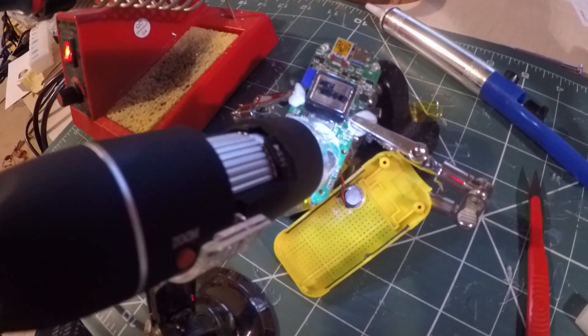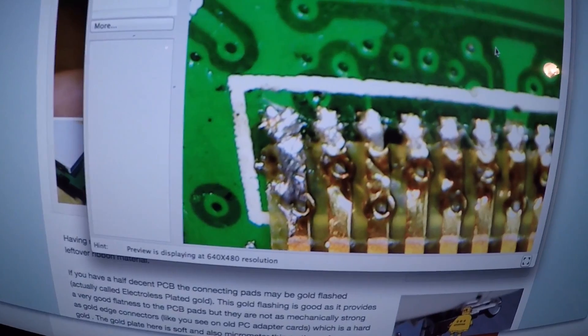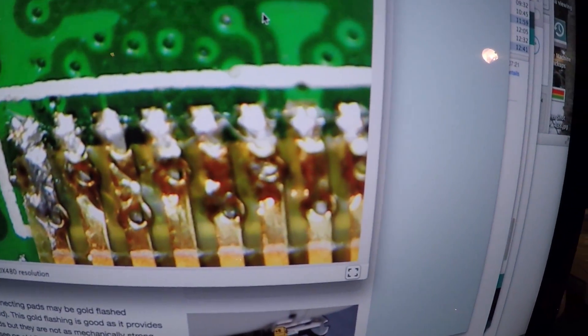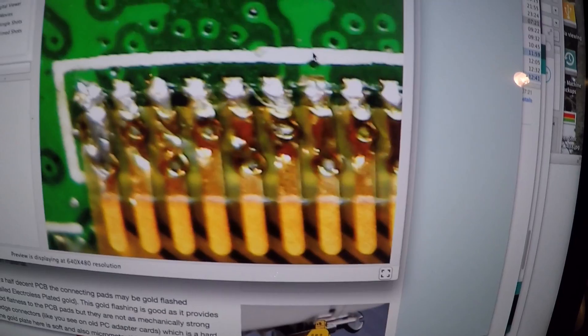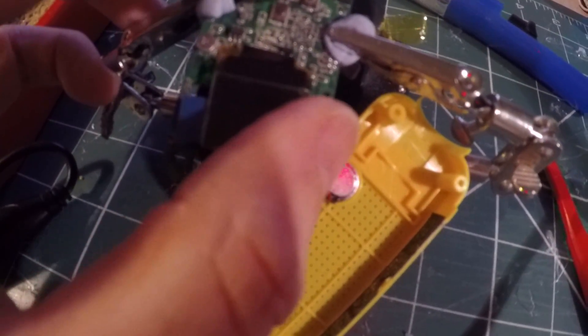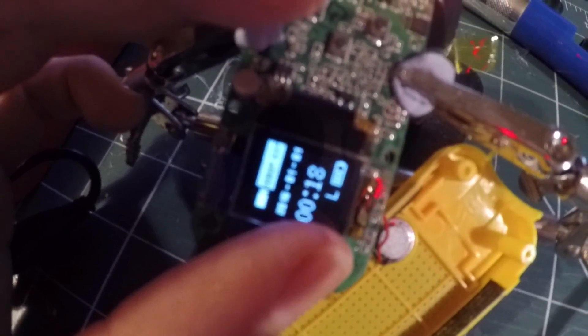I then placed my hot iron on each of the contacts on the new cable with the intention of drawing the existing solder from the old cable up and creating a bridge contact between the old and the new. The first attempt looked okay, but it was really too small to see in any detail. The screen didn't power up. So I used my little USB microscope — there's a review for that somewhere — and I could see that some of the contacts the solder hadn't flowed all the way over. So I redid and rechecked, kept doing that, and on my fourth attempt: success. I have to be honest and say this was way more luck than skill.